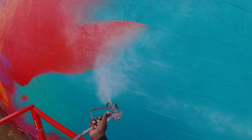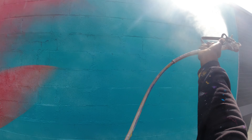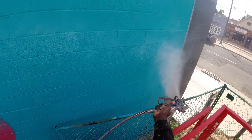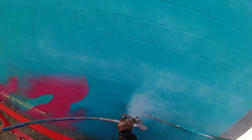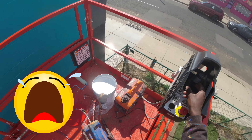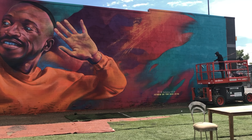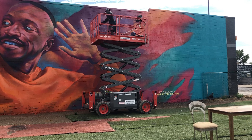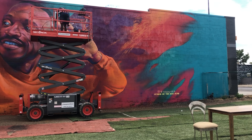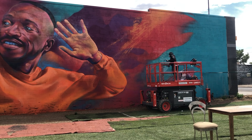To start, all I'm going to do is just start from top to bottom, top of the mural, mainly because the anti-graffiti coating does run down a little bit when you're putting on heavy layers. So that is why I'm using a light mist and thin layers, just going through and hitting it lightly. What I don't want to do is stay in one area too long so that it builds up and starts to run down the wall.